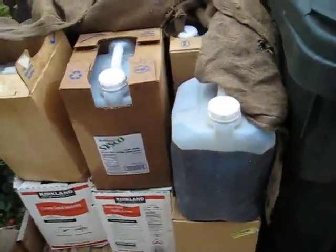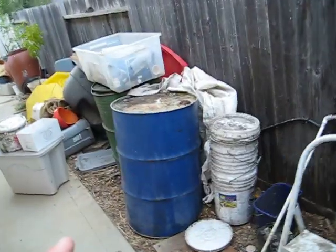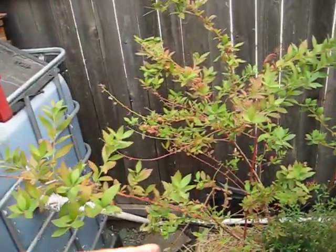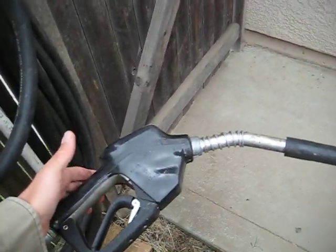So that's about it. To recap: the dirty oil goes either into the top of the barrels or into the settling drum for more settling. It goes through a primary filter, then a secondary fine filter into the bottom of the tank. It gets pumped out by the auxiliary pump close to where I need it. And there's nothing like seeing liquid gold — clean waste vegetable oil — come out of a gas nozzle.